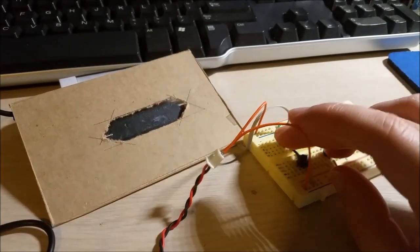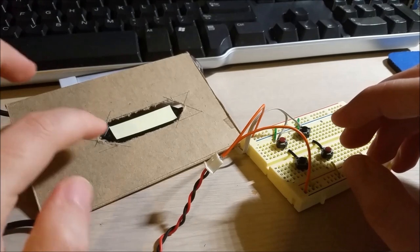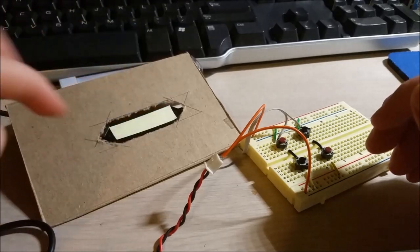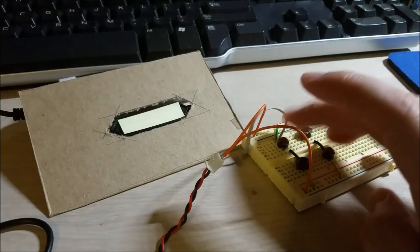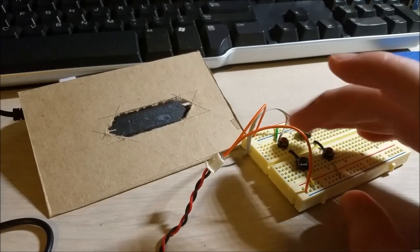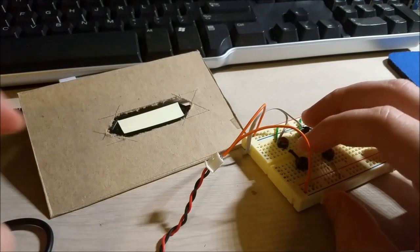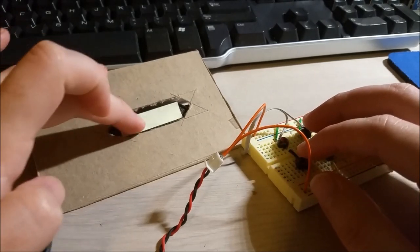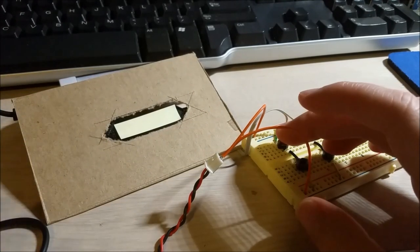I'm just going to keep playing with this — it's really fun. I have some sticky-back glow-in-the-dark paper, and I can cut that out. On the other side I could put UV LEDs, so maybe once per minute after it gets dark it will flip all the digits off to charge the glow-in-the-dark paper and then flip the correct digits back on. That way it works in the daytime and at nighttime you can actually see it — in pitch black there's obviously no illumination otherwise.